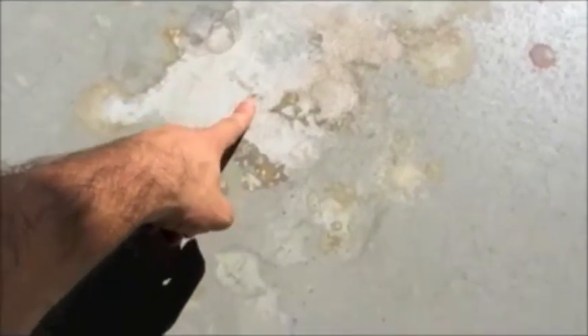Inside our customer's garage — this is a good learning experience and also very common. The white stains are concentrated sulfuric battery acid. We've done core samples on some of this stuff, and these white stains can actually travel throughout the entire depth of the slab.